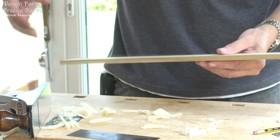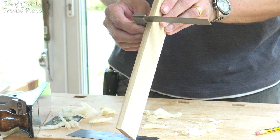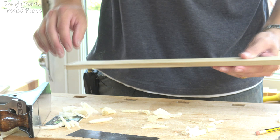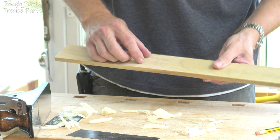We should check the planed edge to make sure that's still square. In this case it actually is — it could have gone out of square, but that's pretty good. I'll shoot that once just to make sure; there was a slight bit of twist in the wood so that should show itself as very slightly out of square somewhere along there. We've got this rough edge that we do need to plane, and also we want to bring it to the correct width. I'm going to bring up what I call my Japanese shooting board.